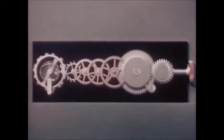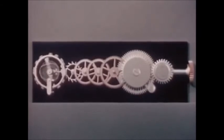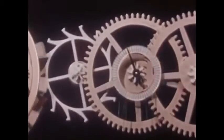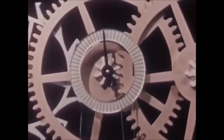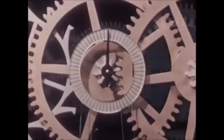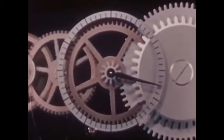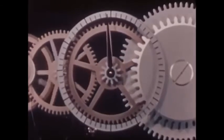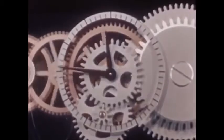All we have to do now to measure time is count the ticks, but this would be a tedious job and not very practical. So, to the shaft of this gear or wheel, we add an indicating hand to measure seconds. As the gear train of a watch moves far enough to make five ticks of the escapement, the second hand moves one graduation on its dial. To count the minutes, we attach a dial and fasten a pointer to a gear wheel just the right size so that it turns one complete revolution while the second hand makes 60 revolutions. And to count the hours, we have another pointer geared to move one complete revolution every 12 hours.